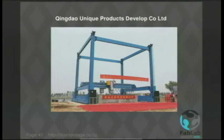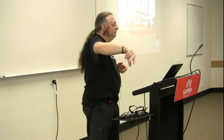But that's not their biggest 3D printer either. Here we have 120 tons of Chinese pride — a 12 by 12 by 12 meter build volume. It prints with graphene glass-fiber reinforced plastic and it's part of an expo, where the printer will be printing a 7-meter tall model of the Temple of Heaven, China's largest sacrificial temple. I like the twin-head design: one head on each side of the rail, so while one head is printing, the other can be moved aside for reloading, maintenance, or just so it doesn't dribble over everything the other one's printing. I think I'm going to swipe that for my next printer design.